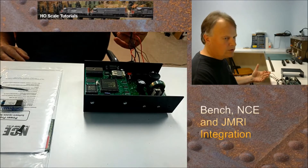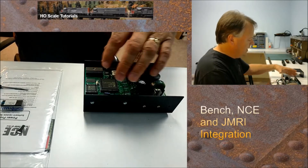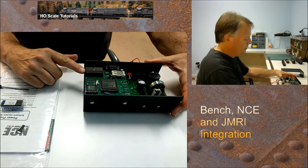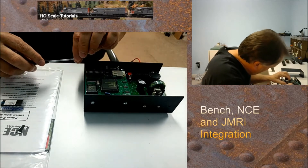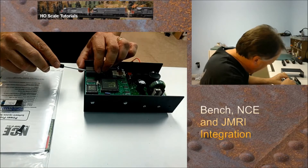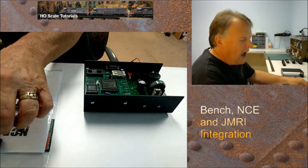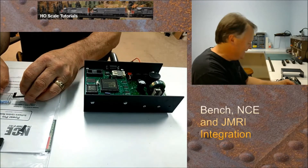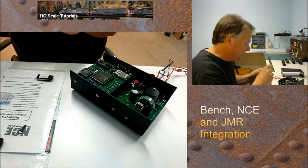The chip is in the lower right-hand corner as you're looking down on top of the unit — this integrated circuit right here. We're going to pry it up, and you want to be very gentle doing this, always avoiding the pins or leads. I cheated a little because I loosened it already, so yours won't come out quite that easily, but it's not difficult to remove.